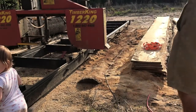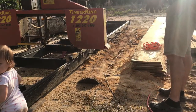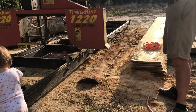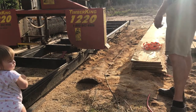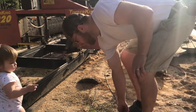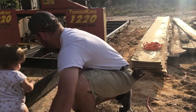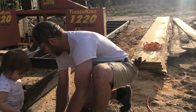It's slipping quite a bit, and the guy at Timber King was actually pretty cool about it. He said if you just put a slightly larger cable on there — so he said 3/16ths is their standard size, but the pulleys they have are big enough to accept almost a 3/8ths, it looks like. So I'm gonna see if I can swap it out here.